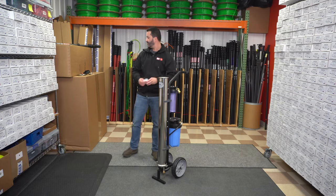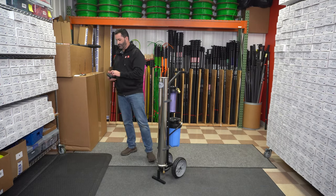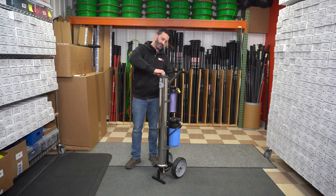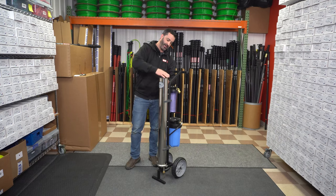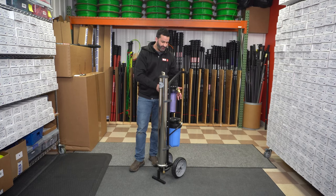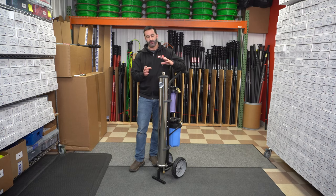When it's fully empty, just put your cap back on, seal everything up together, put the clamp back on, and your pure water system is good for the winter or an extended period of time. We've emptied out the disposable filters and we're going to protect the RO membrane, which is doing most of the work and is your largest investment in this system. Thanks for watching.